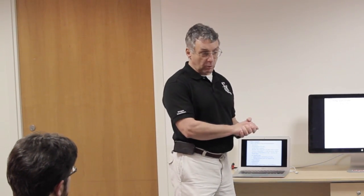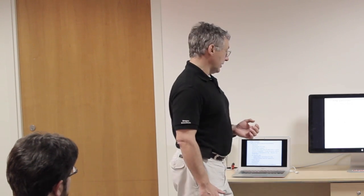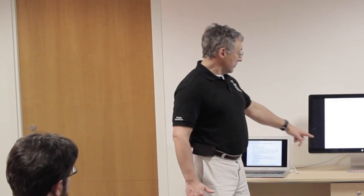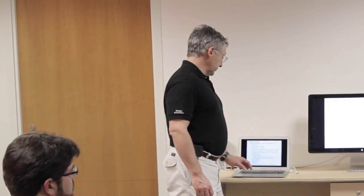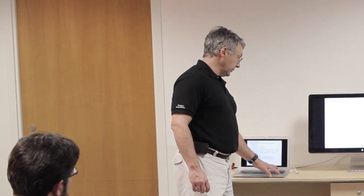Temperature, I mentioned silicone. I used to have to seal high temperature chambers, and so it was always a struggle to cool the O-ring. Most of your products will probably not be heating their O-rings to over 200 degrees centigrade as I was, so probably not a problem. And the most important rule, get the Parker and the Apple Rubber O-ring handbook and follow its instructions. If you're ever using an O-ring, that will get you where you need to go.